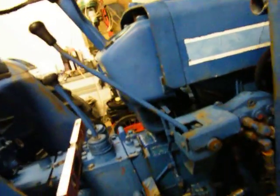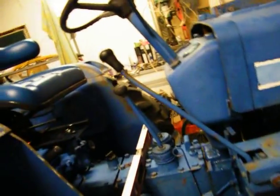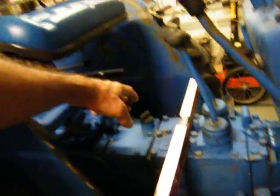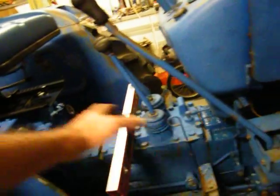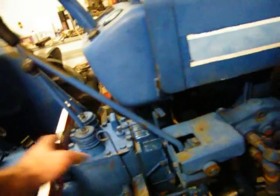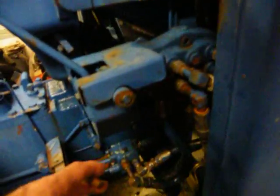Both directions level, so when I drain the hydraulic fluid it'll all come out. I'm going to take a heat gun, put it on low, leave the bottom case bin open, and just flood this with nothing but warm air to try to dry some water out of the casing. I'll probably have to let it sit for two days like that — take all these lines off, let them drain completely out. I've got to get all the water out of the system.